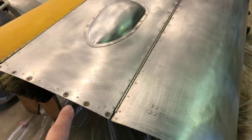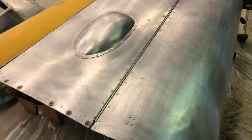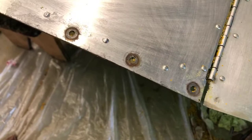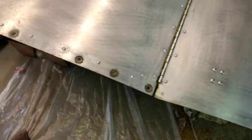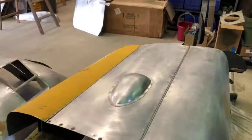That's the finished product from just the stripping process. Before painting, we'll probably go over it with Scotch-Brite because it's in really good shape. You can actually see a little corrosion right here around these fastener holes — these were 3/16 bolts with washers that screw into nut plates on the firewall. You can see where the steel washer was against the aluminum — it acted like a little battery and made a little corrosion spot around each hole. Those will be burnished out with a Scotch-Brite pad on a wheel to polish the corrosion off.